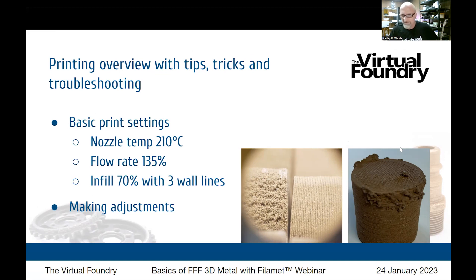In the second cylinder picture, that's an example of over-extrusion. In that example, it's laying down so much material that it has no place to put it — it all gets pushed to the outside and winds up as unpleasant attachments on the outside of your print piece.